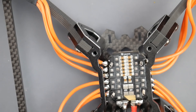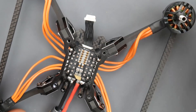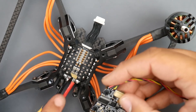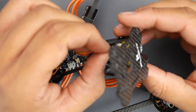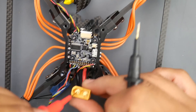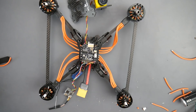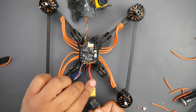Now the ESCs are in place. Using the wire that comes with the package, I plug it into the ESC, then bring in the flight controller we finished earlier. Find the front arrow key on the FC - this is the back, this is the front - and plug it in. Connect the camera. Once everything is connected, bring out a multimeter in continuity mode: grab the XT60 connector, touch one side and then the other. No beep - we're good to go. Let's plug in a 6S battery and see what happens. I'm using a 1300mAh Infinity 6S - I really like these.